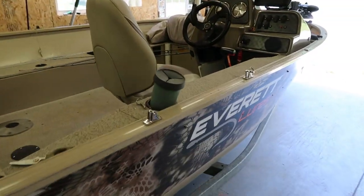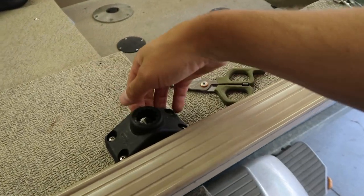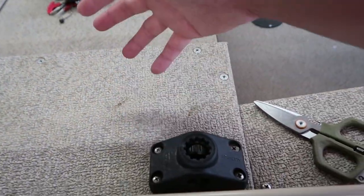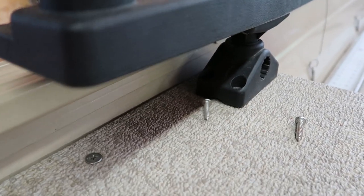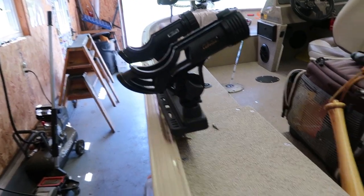Let me show you some of the issues I had. I have a bimini top that connects to the windshield with side curtains, so we can't put rod holders anywhere up in here — they've got to go back in this section. What I did when I first got this boat is I put these Scotty locking rod holders on. This one's held up pretty good, but you can see here this is where the metal is for the framing — so this is all just wood right here. These screws are anchored into wood, these are anchored into metal. This side came up hard on me — you can actually see this screw right here is backed right out. So that's all loose now. I could put a bolt with a washer on the back, but that's really not the right way to mount those.